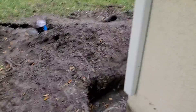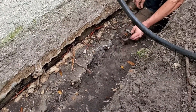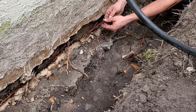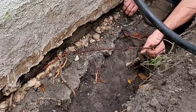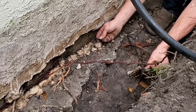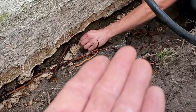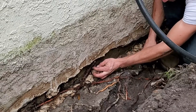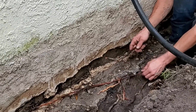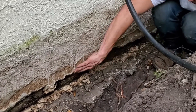We've got a man back here pulling out tree roots — take a look at the root system that grows right into your foundation. There are big roots that grow along the outside but are attached to the wall and actually penetrating it. There are microscopic holes or larger holes, and water travels through those roots and gets under the floor. It may not seem like a lot, but it's quite a bit. This water gets under the floor, rises up, and causes problems inside the house. Most people have a typical problem where hardwood floors are buckling and scarring, or tile floors have efflorescence — which is exactly what's going on here. We'll pull all those roots off, clean it, wash it again, then paint it with liquid rubber.